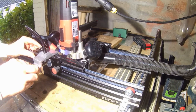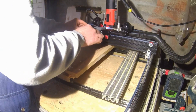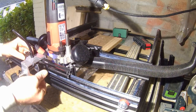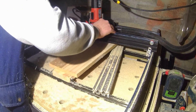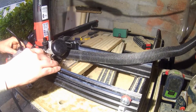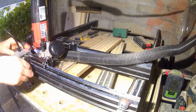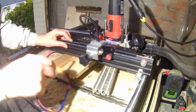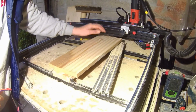There was nothing wrong with the original version 1.0 sled for rough flattening of boards and small slabs, but I feel it was let down a little bit by the old Bosch plunge base I used to mount the Mafell motor. Only really meant as a DIY base, it lacked the ability for fine adjustment and the plunge was a bit clunky. It did have a 43mm collar though, same as the Mafell, which is why I used it in the first place.